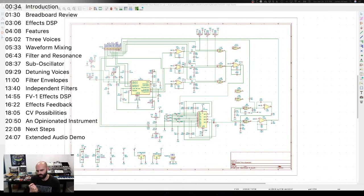But the other thing that I want to do here is to make sure that this is not just limited to people with modular gear, but to make sure that there's also a digital to analog converter that has the ability to drive those as well, so that out of the box it'll obviously support the basics of the MIDI notes and velocity, and we'll do some interesting things with velocity controlling the amount of that sort of envelope driven filter modulation that we were hearing there.